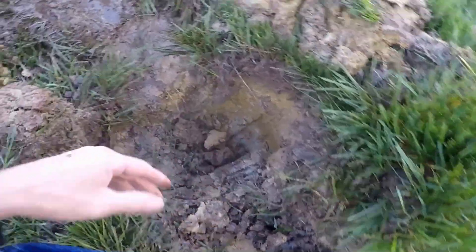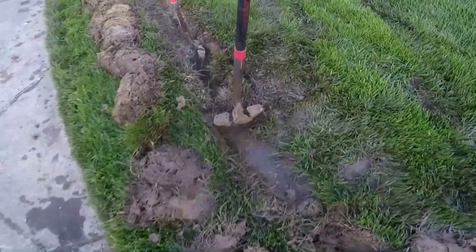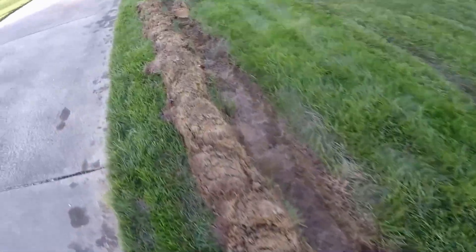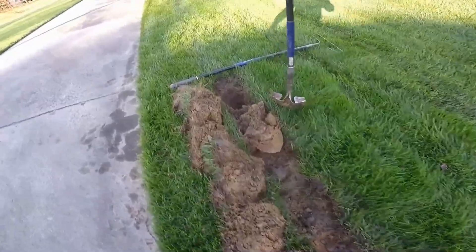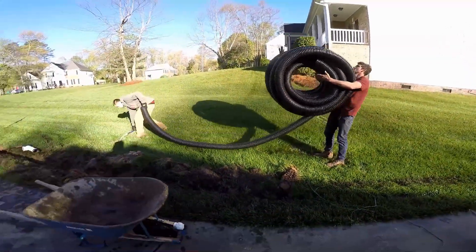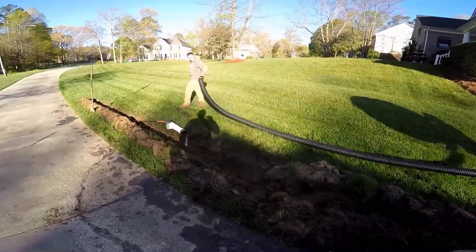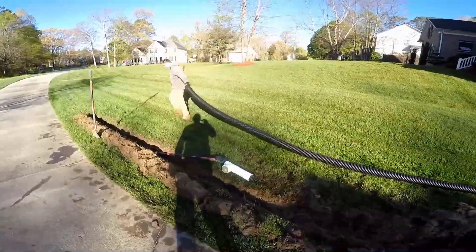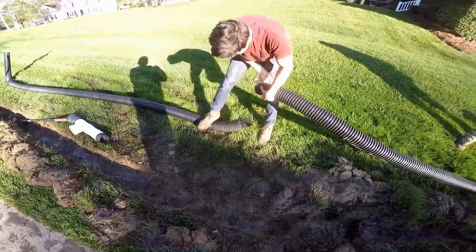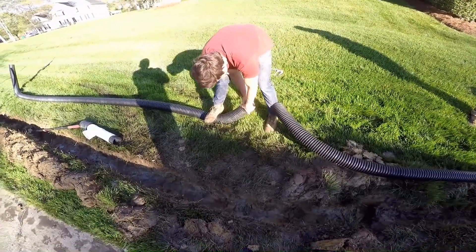You can see our old existing line right here. We're going to attach to this gravel perforated pipe. You can see all the water that just lays on top of the ground — that's why you need the gravel, so it can help water get down through that soil into your system, and then the pipe carries it away. Now we're just rolling out enough pipe to get down in the trench — about 30 feet. Looks good, go ahead and cut that off.